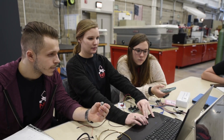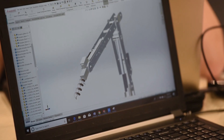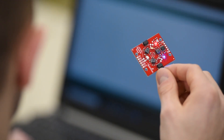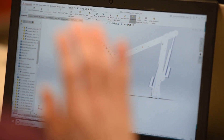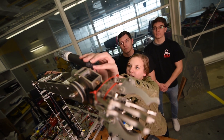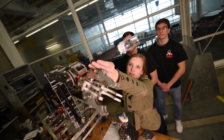The science task team opted to use an auger for digging a hole into the ground, and then using that same hole we are able to plunge sensors into it to collect data for possible life detection. The purpose of the science task is to determine whether extinct or extant life exists. To do this, we will insert an auger into the wrist. The auger will then drill six inches into the soil. The wrist will rotate 180 degrees and release a linear actuator containing various sensors into the soil.